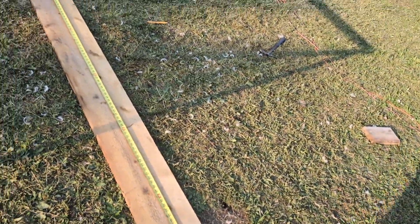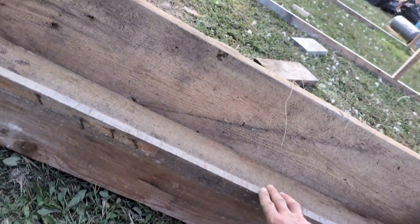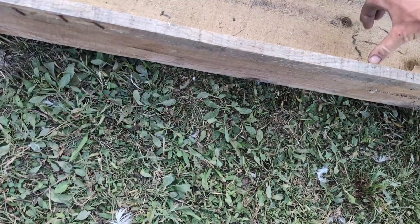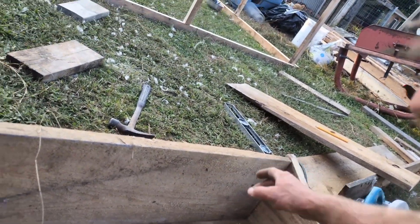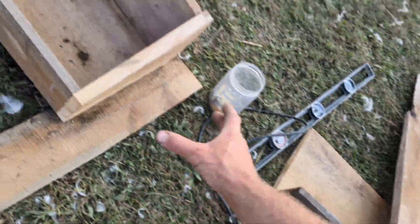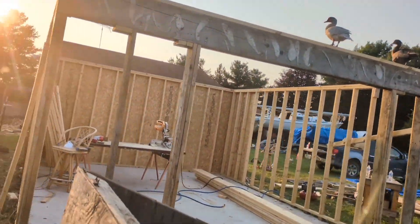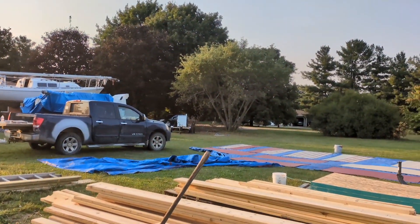Here are the feeding troughs coming along: five and a half inches tall up front to get their head in nicely, ten inches tall in the back, ten-inch base from front to back, sloping up to meet the backboard height. Big legs go on the sides, sunk into the dirt in the pig pen. Same idea for the goats. The barn is going up — it's level now, T1-11 on the walls, still more to paint and lumber to build.